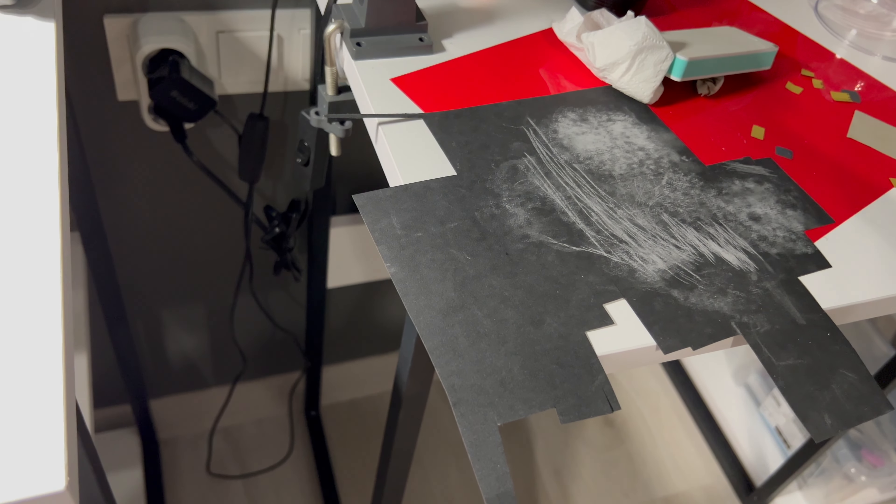It's also very important to push the armor ring perfectly. As you can see, you can almost not see the place where the rings meet — it needs to be perfect. The two sides of the ring need to perfectly accept and match each other, otherwise the dial is going to be stressed and the ring needs to be perfectly seated. Otherwise the dial won't be uniformly supported, which will cause damage to a very rare dial.